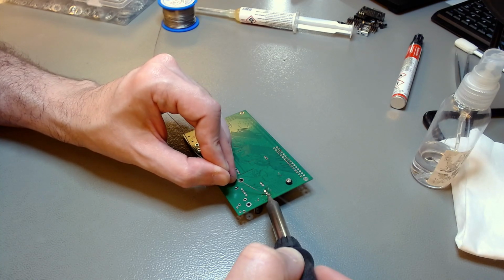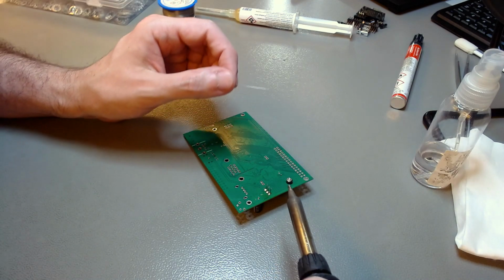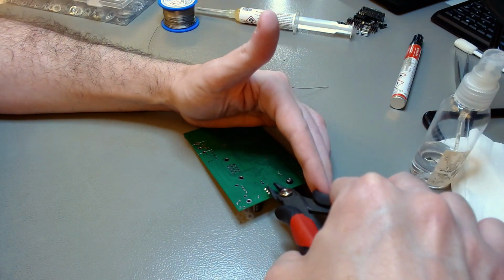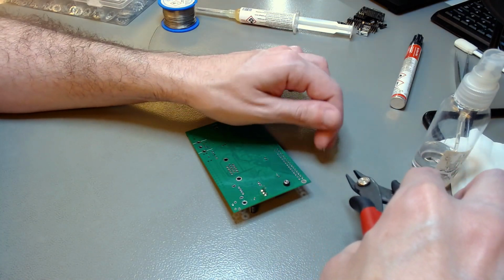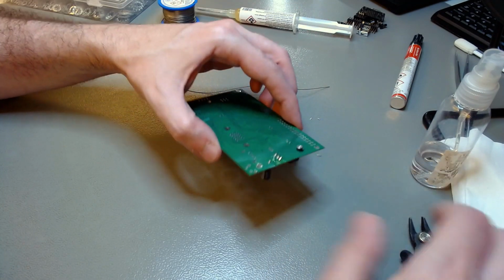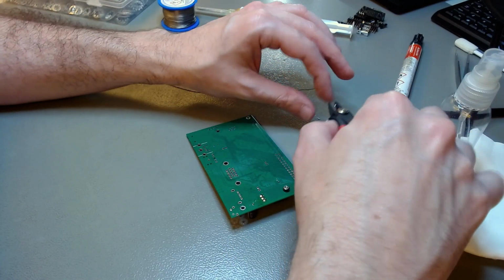And then after the three of them are soldered, we just clip the excess leads and give it a clean with that tried and trusted method using Kimwipes and IPA. I'm just clipping the excess leads now. This is all in real time. Again, I don't want to give you a sanitized impression of what it takes to do this. There's still one lead that's a little too big, so I go back and clip it off a little further.